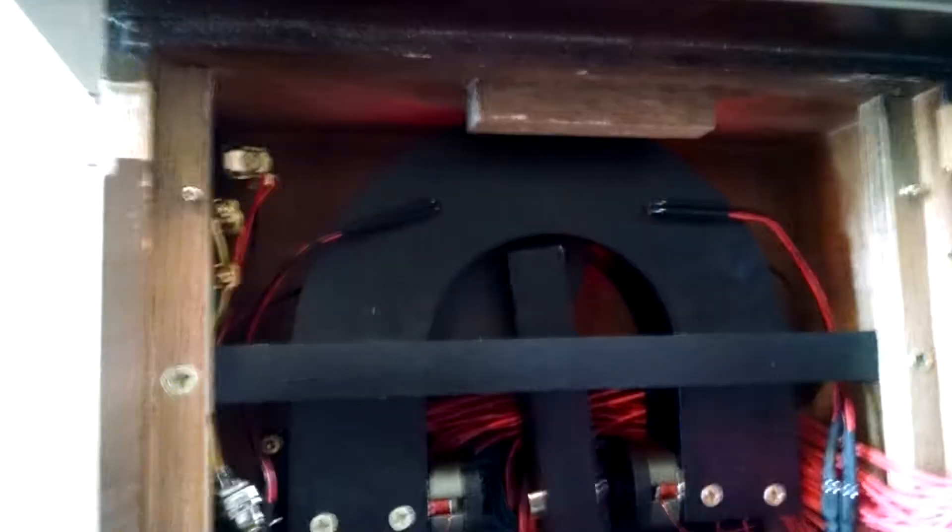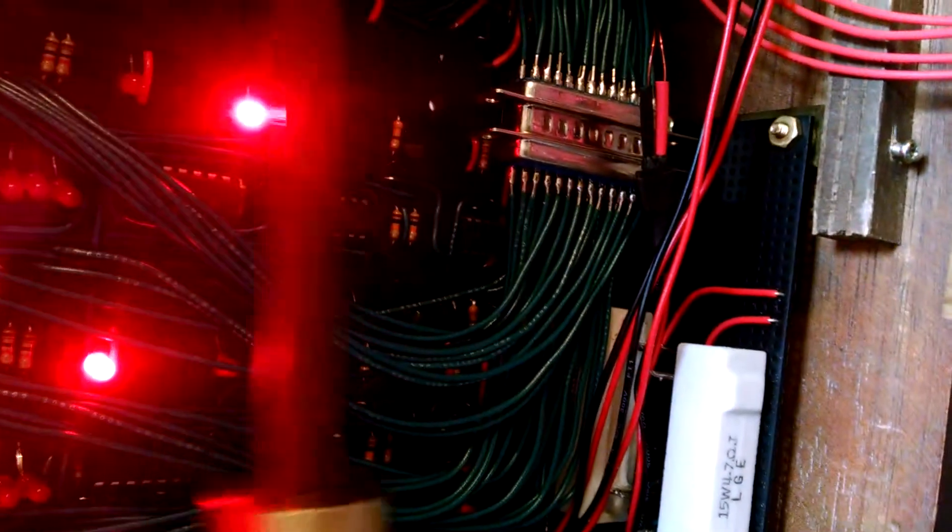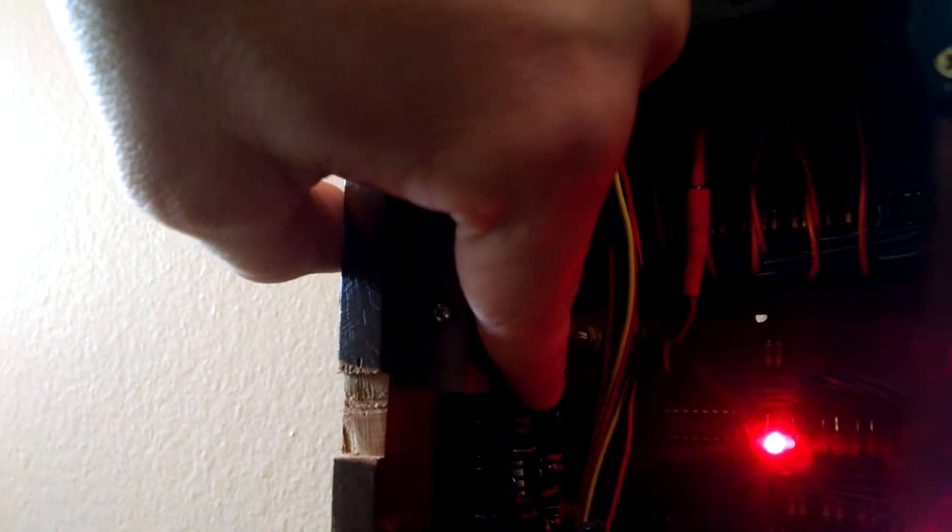The sensor on the left detects when the pendulum reaches the bottom of its swing, and that's responsible for timing the coils — keeping them in sync with the pendulum. There's a small board on the side with a sequence of flashing lights. When that slit lines up with this sensor, an LED flashes to indicate the pendulum is at the bottom position, which then activates the two pulsers.